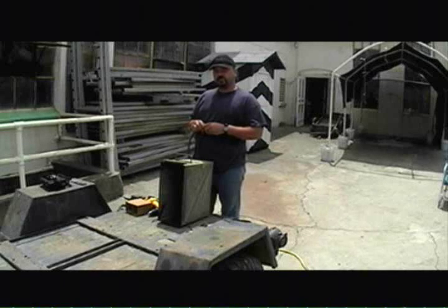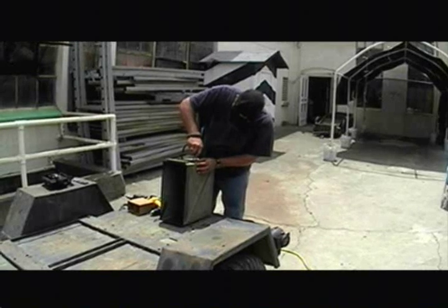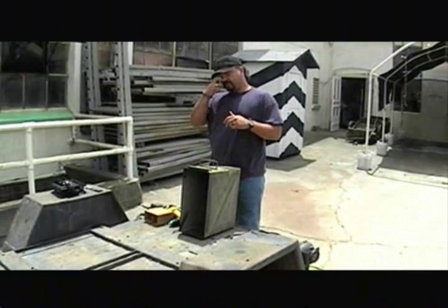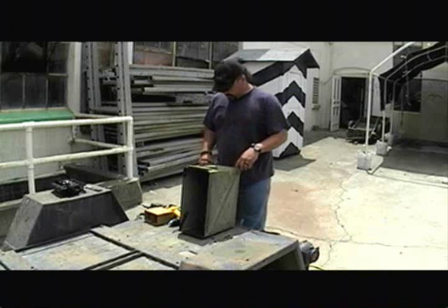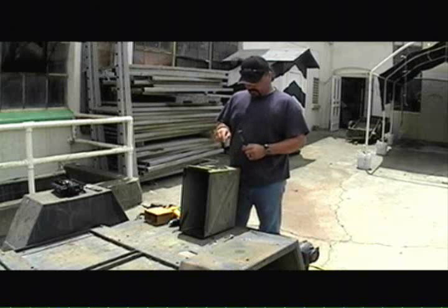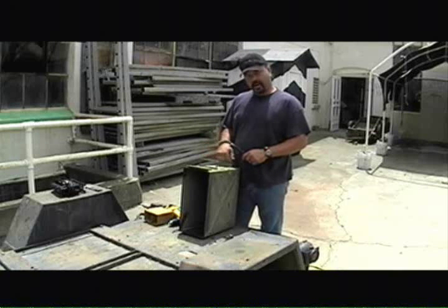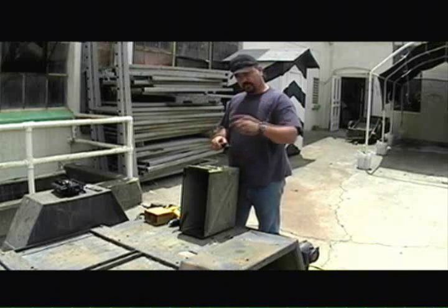So what we've done so far is we started cutting on the lid of the ammo can to put the smokestack. The guys took the lid down to the shop; they're going to use a press on it because it had some crossmembers we couldn't get through with the Dremel. They're going to try to use the rotary cutter to circle through it. Right now I'm putting the hinges for the doors on — I drilled one pilot hole, put in one screw to hold the hinge down, then I'll drill the other three holes and do the same for the next hinge. Then I'll take it off and cut the door out, so I don't have to cut the door and then try to drill matching holes.